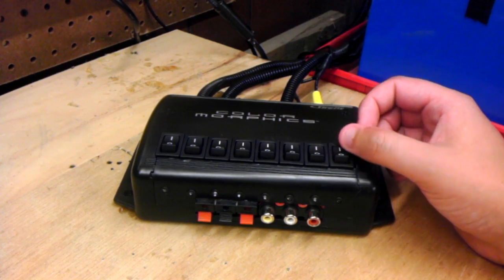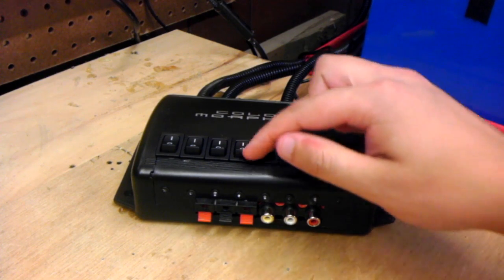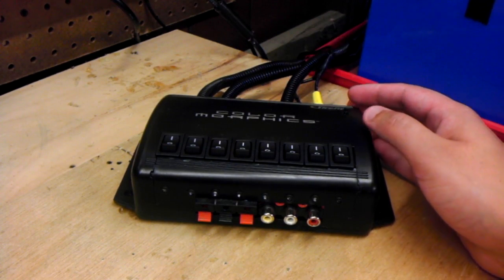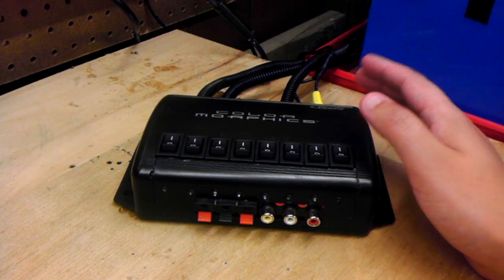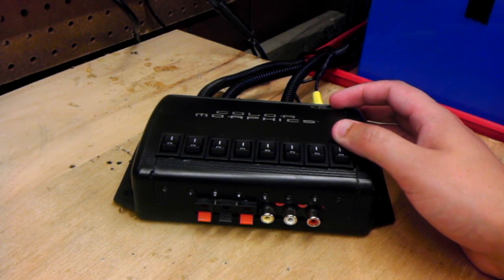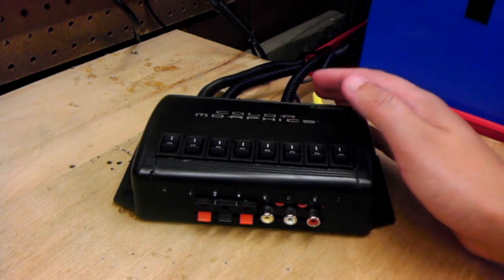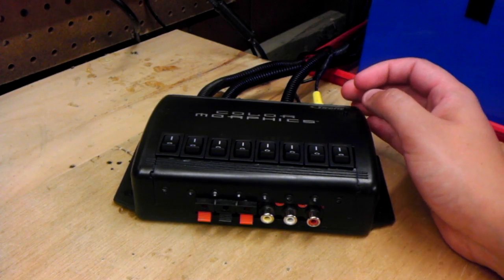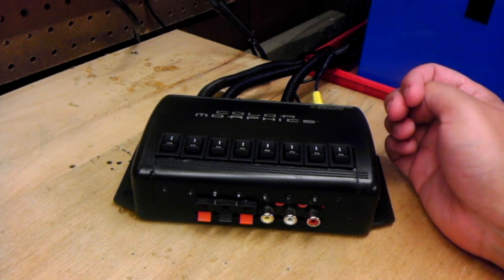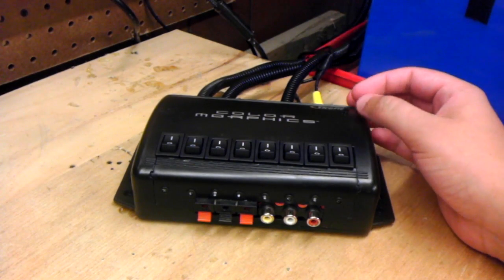To combat that, I have two separate channels, each with four different voltages. I'm showing this now because it's not complete yet — I'm going to be putting in a couple of adjustable regulators, as well as an LED voltmeter in the top to tell me what those two voltages are at. That will give me a full range of voltages from 12 volts down.